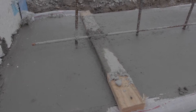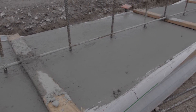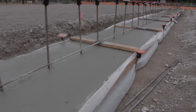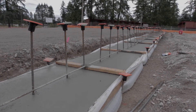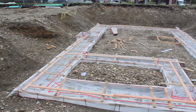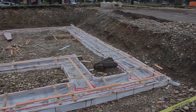Fast Foot is also a vapor barrier that encases the footing to prevent any weeping of moisture through the footing and into the wall, which could cause dampness in your basement, more water getting into your slab, etc.